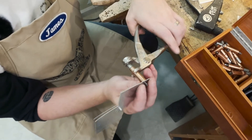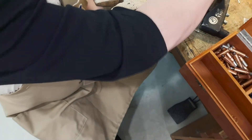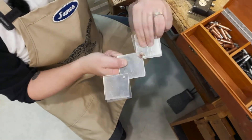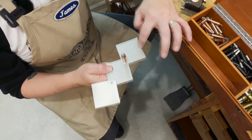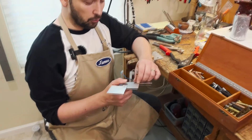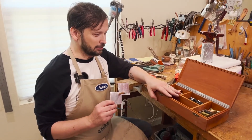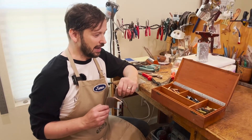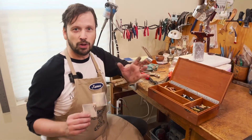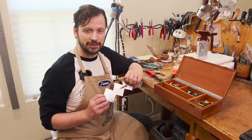You slide the Cleco in and it's held together. You get the next piece, slide it on, release the tool, and it's going to relatively firmly secure everything together. So if I needed to drill and position a bunch of other holes for more material, it would be temporarily positioned — and if I want to shift things, I don't have to drill out a rivet or anything like that. The Cleco is a lesser-known tool outside of larger-scale sheet metal working — something I didn't become aware of in my training as a metalsmith or sculptor — but these tools in conjunction with each other are really versatile and can let you build a whole lot of things out of sheet metal. Just wanted to share that little discovery of the Clecos with you, as well as how to put things together quickly with pop rivets. Have a great time — I'll see you next time!